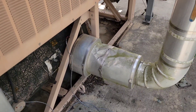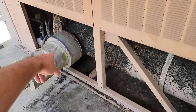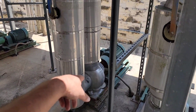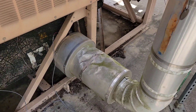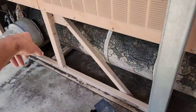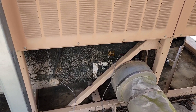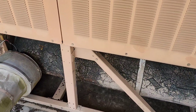That was almost a really big screw-up. What I ended up doing — I almost wired in incorrectly. What I thought was our leaving is actually our entering. I was double-checking myself, looking at the pipe, and I realized the pumps are pushing from the chiller to the building and back through the building into the chiller. So in reality, this is our entering and that's our leaving. I was wondering why my sensors on the display just did not look right. That's always why you verify — always, always verify. It's not a big deal; all it means is I switch the two harnesses and it fixes that. But that could have been a really big mistake.